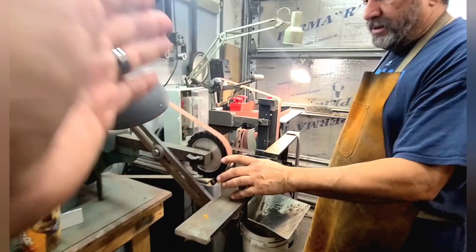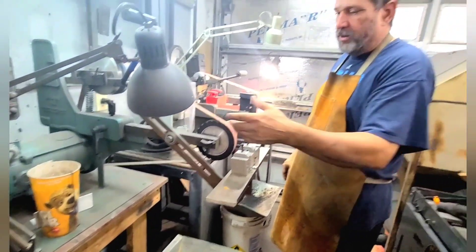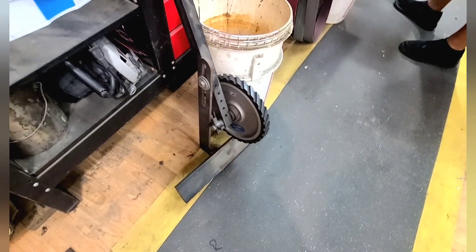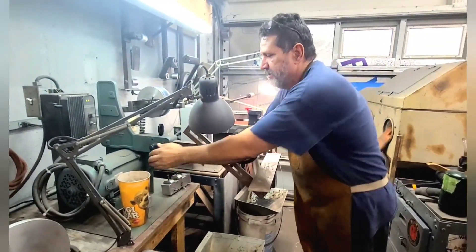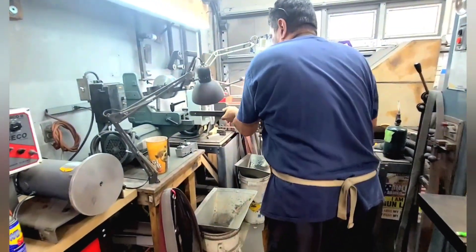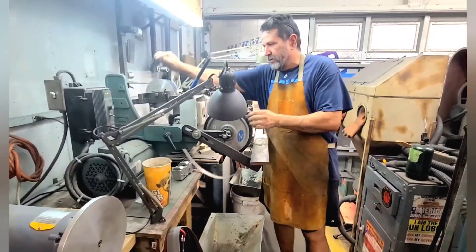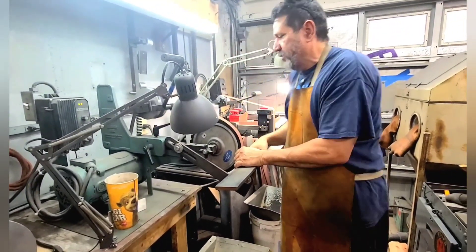And this one is for? This one right here is my main grinder — this is the one I grind my blades. Right here with a bigger wheel. This right now has a small wheel because I was doing clips, the top part of the blade. You said this was the wheel for your hollow grinds? That's the wheel for the hollow grind — it's a 10-inch wheel. So you just unbolt that sucker and put this guy on there. Basically really simple — you just take the belt out, three bolts, easy as that. Attachment out and the other attachment comes back. Very nice. And I just tie it with my belt. Right now all I'm doing is profiling work and grinding some little screws, so I have an old belt on it. But normally every time I do a blade, I just go with a fresh belt.